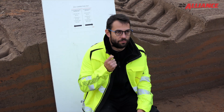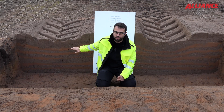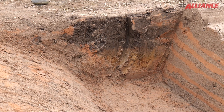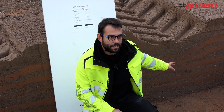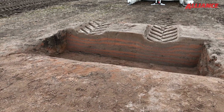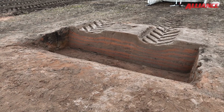This is important because, considering the structure of our soil, with VF tires the compaction acts only on the layers that the customer can plow or till. With standard tires, the compaction goes deeper into the ground and reaches areas not touched by plowing.